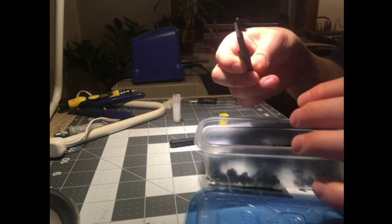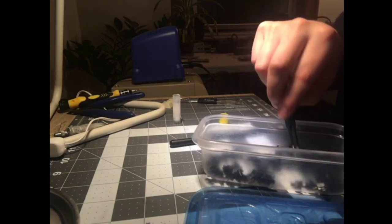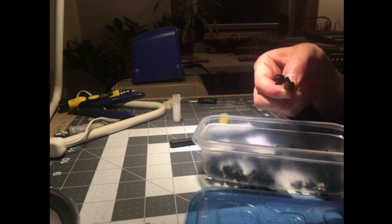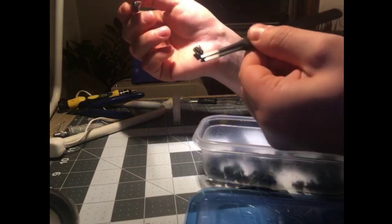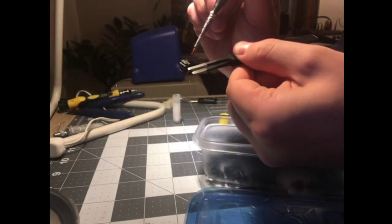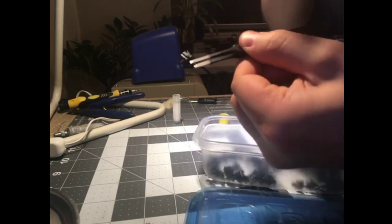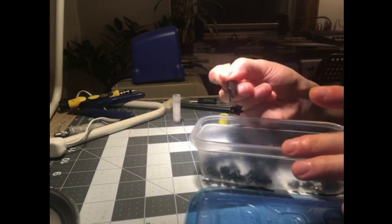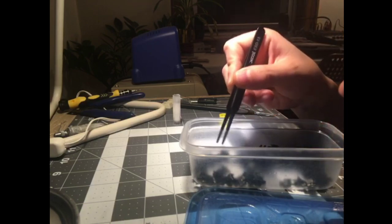So what I was looking for when I peered into the abyss, and in fact, I don't even like how this is coated now, but I'm just going to go with it because I've committed. I don't want to rebrush all of them. So it's nice and shiny. There's the crevice between the rail here and the body of the switch, there's a little bit of a bare patch in that crevice there, and I don't think it matters that much, if at all, but that is one downside to this method when you're using a grease, is that it won't necessarily get into all of the tiny corners that maybe an oil would.